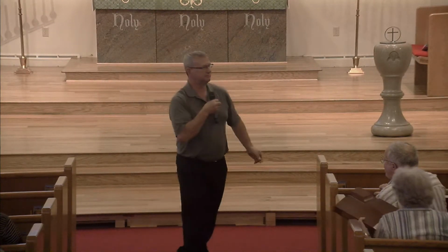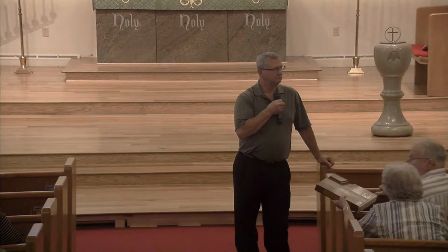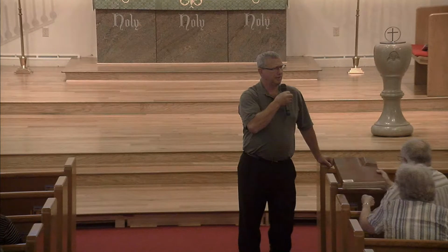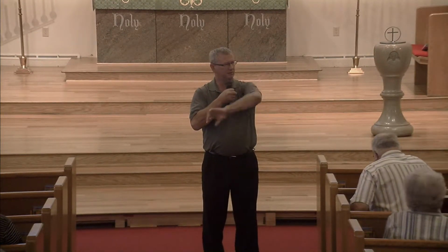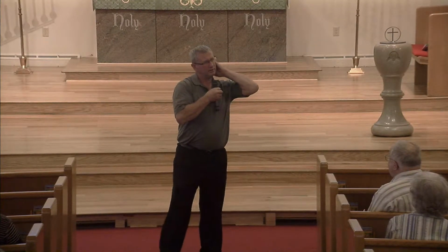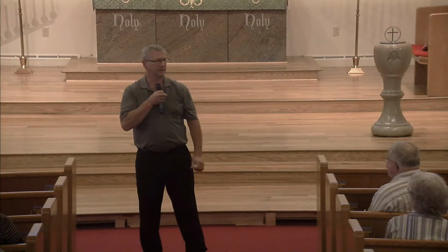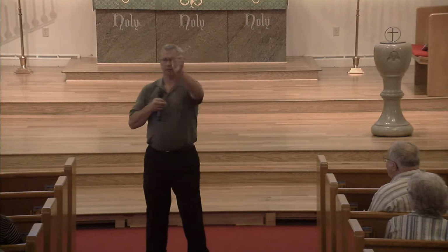Yeah, Joel. Having the door frames, do they remain wood or are they fiberglass also? Jason, do you know that answer? He was asking if the frame comes fiberglass too, or is it steel? I guess we don't know that answer. We're going to have a middle mullion between the doors because of the panic bars. I would guess it'd be steel. Steel frame. But we got to have a middle mullion in the middle just because of the panic bar to attach to something.